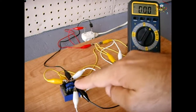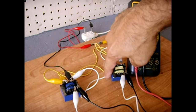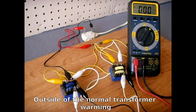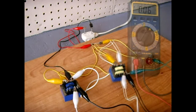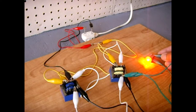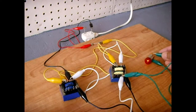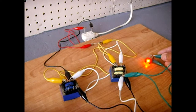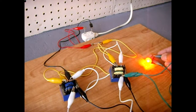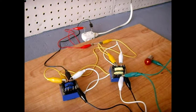I left this connected for over an hour and didn't notice any heating issues, so it does work fine. Taking a bulb — that's two in parallel. Let me remove one transformer and you'll see the voltage drop due to a lack of current. When I turn it on, it even goes on slower. This is one transformer — see how slow it goes up? Now I'm going to put two on. Much brighter and goes on faster. Let's remove one again — it dropped. So you see how simple it is to join two transformers together to give you twice the output.